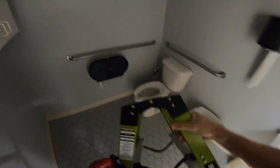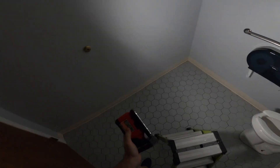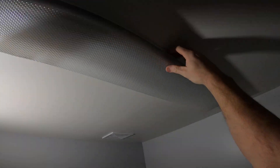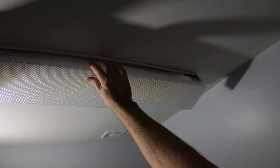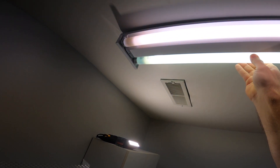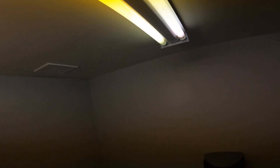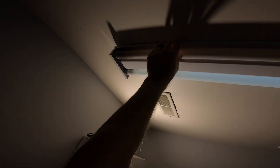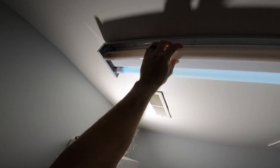Here's the culprit. Turned on the light to see what we've got - you can see a very faint glow. I'm going to get up there, take the cover off, and see what the bulbs look like. The lights are almost flickering as I take the cover off, as if they weren't in the right location. I can move them around and get them to come on, but they're still not right. You can tell by the color of them they need to be replaced - most people at this point would say just change the bulbs, the ballast must be good.